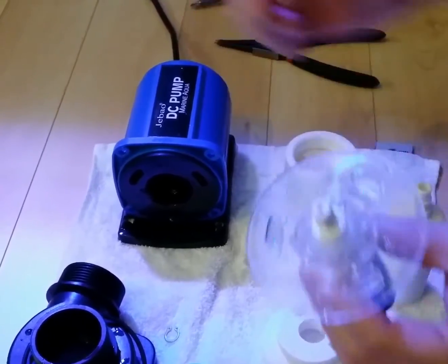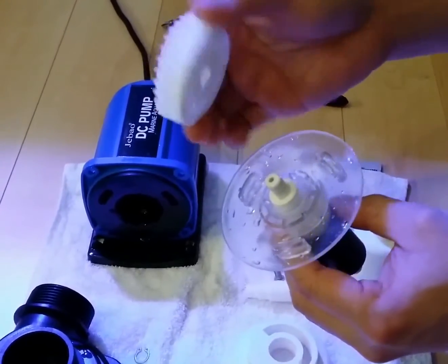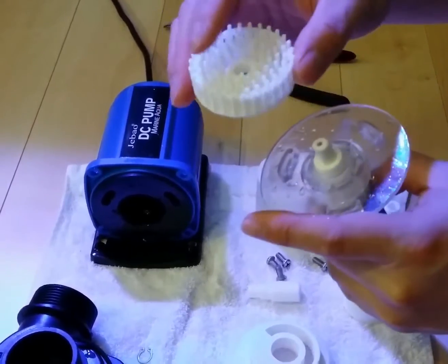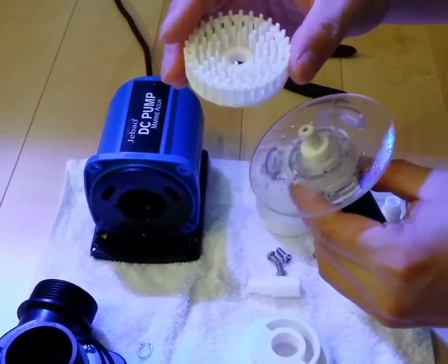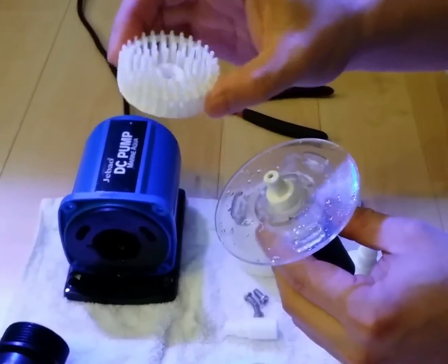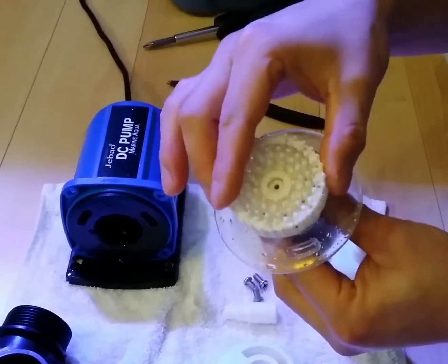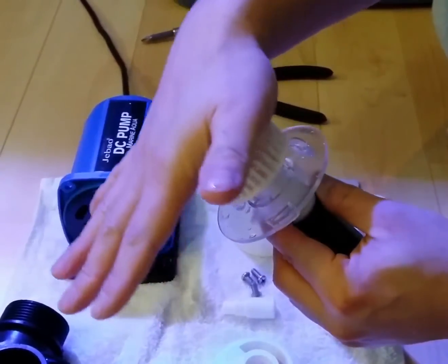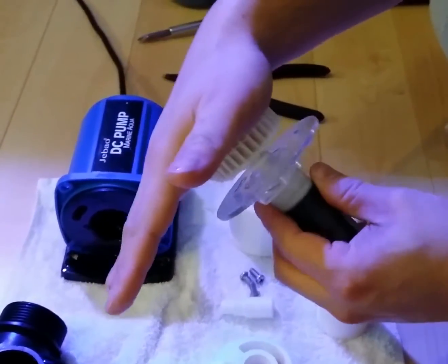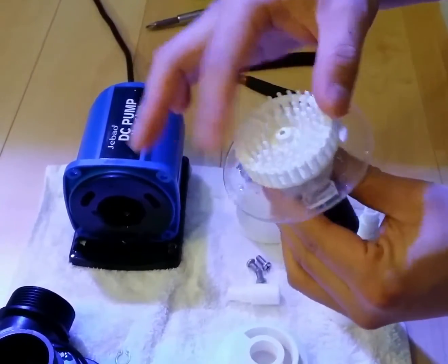That slides all the way down, and then you take the needle impeller. All the needles are very fragile, so don't press down on one or at an angle — you'll actually break it. What you want to do is hold it on the side like this, then line it up so you can fit it in, and then use your whole hand so you're pressing down on all the surface of the needle straight down. That pushes it all the way down to the spacer.